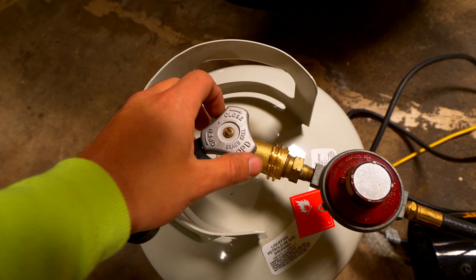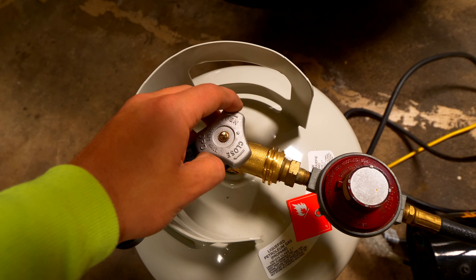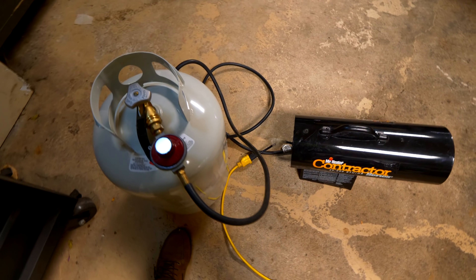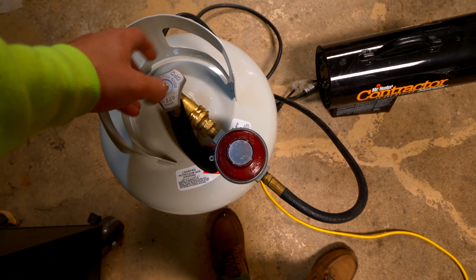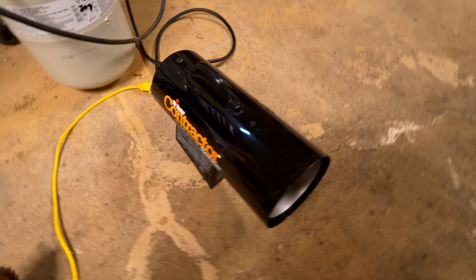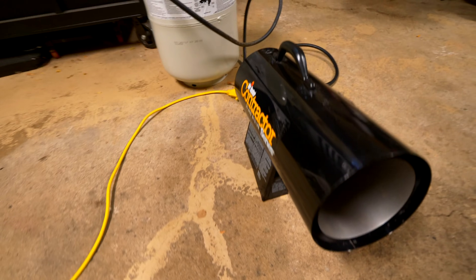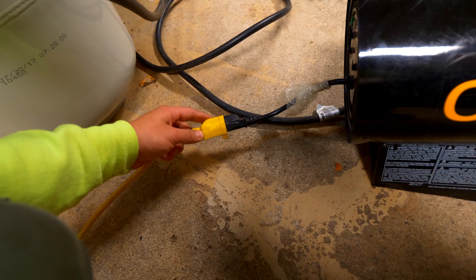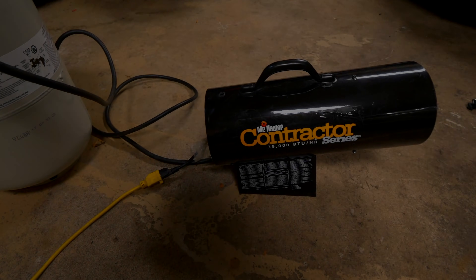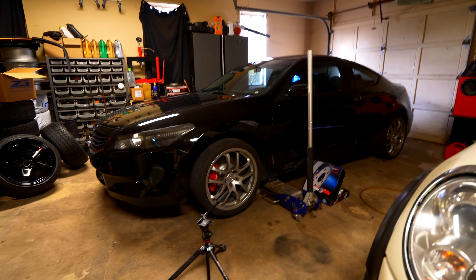Something pretty cool too is that you can modulate how hot you want this. Because the dial at the propane tank right now is at full open, you can turn it down and start to close the valve, and you'll be able to modulate how much propane is coming out of the tank — which means how much propane is being burned — which means you can control how hot your garage is going to get. When you're done, turn the tank valve first. That will stop the flow of propane from the tank to the heater. Once that's done, verify that the flame is burnt out, then disconnect the power. After that it's going to be quiet, and the garage is going to maintain the temperature it's at now.